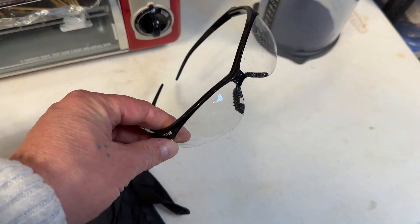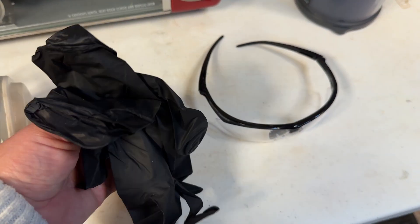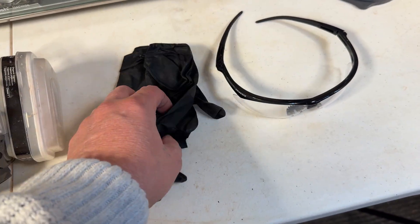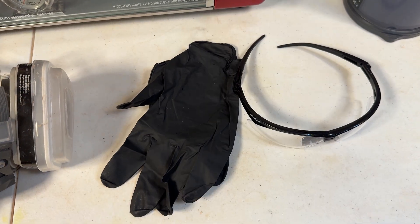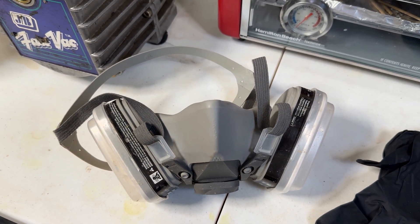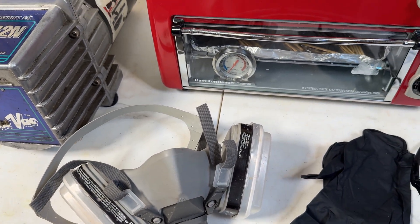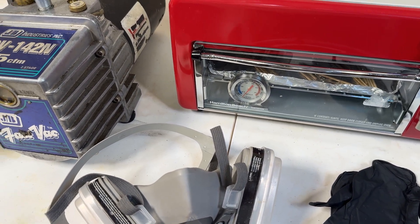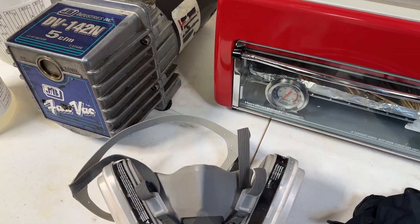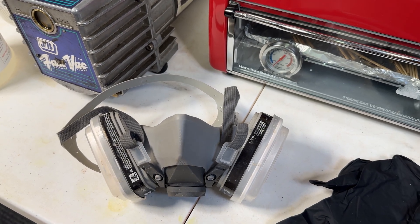The two most important pieces of PPE are a general pair of safety glasses — you don't want resin splashing into your eyes — and gloves. I use nitrile gloves; it's just best practice for handling any chemicals. I'm also going to be using a respirator because although I have ventilation in the shop, it's not the greatest. When you start to cure the rocks it does give off a little bit of an odor, and when the vacuum pump is running the oil heats up and you get that oil smell. I'm going to be wearing a respirator when the equipment is running.